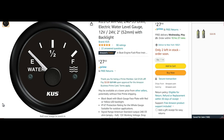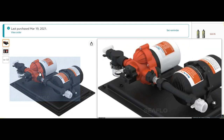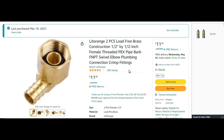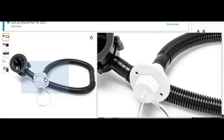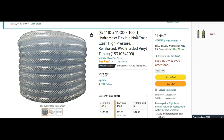These are the water level sensors — they come in different sizes depending on which fresh water tank you grab, and I also installed one on my gray water tank. This is the water level gauge I used for my clean water, and this one for my gray water. This is my 12-volt water pump — it came all assembled with a strainer attached, just connect it to the board and you're ready to go. There's really no vibration, it was an amazing price, and I did not make any alterations to the accumulator pressure — it worked perfectly out of the box. The bigger the drainage tube the better water flow you'll have, so go with a bigger size whenever available, and some sizes may not be available in local stores so shop ahead.